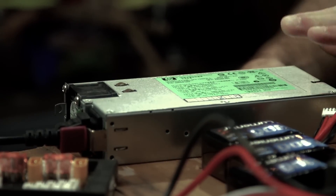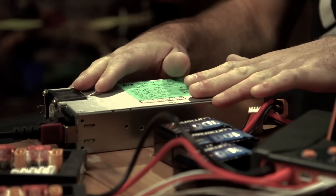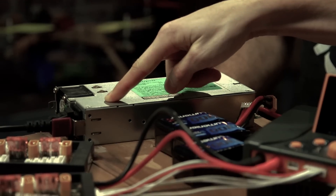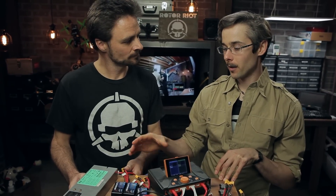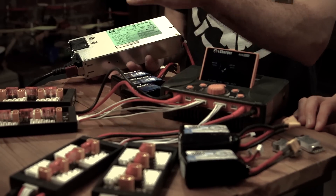What we use is an HP DPS 1200-watt power supply, and this comes out of an internet server. We'll put all the links for this kind of thing in the description. You can get this off eBay — these are old server power supplies and they're still fine, they work fine. You can pick them up for about 30 bucks off eBay. Essentially you're taking your wall voltage — 120 volts AC — and transitioning it into DC voltage, outputting at 12 volts. The only critical thing you need to do when you get it is there's an adjustment inside that will allow you to get exactly 12 volts, and you need to make sure the charger is seeing exactly 12 volts.